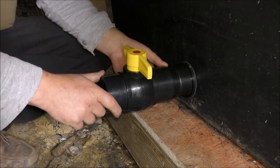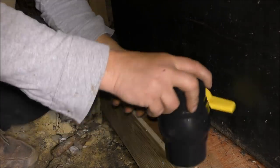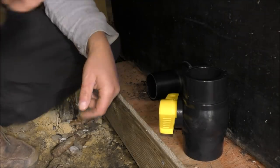Okay, that's our bottom drain in, just ready to permanently fix. I'll just take that off for the time being. And we'll concentrate on the inside of there now. Now there's our bottom drain, right near the bottom there. And because we're going to have small moving bed media in here, we can't just have a bare 2-inch bottom drain. We have to fit some sort of straining mechanism.